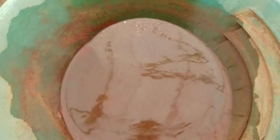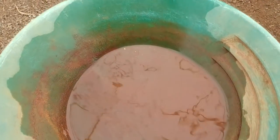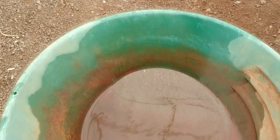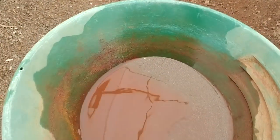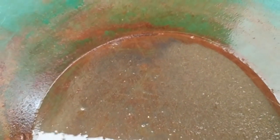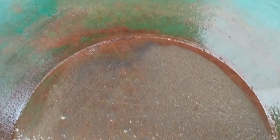Here I've got some of those sulfides in a gold pan and I'm going to swirl these around and show you that there's hardly any gold or no gold that I can pan out of this, and then we'll roast it and see what happens. You can see the huge amount of iron sulfide that's in there — the pyrite — a little bit of black sulfide there at the top, but there's really no gold in there, no bright yellow line indicating any gold I can pan out.